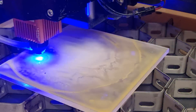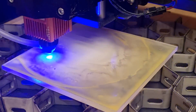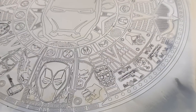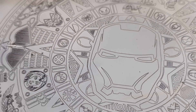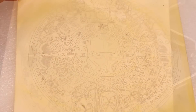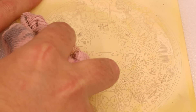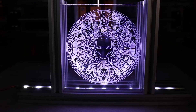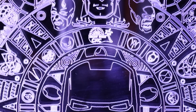Recently I needed to engrave some clear acrylic. A diode laser will not engrave clear products unless you apply something to the surface. So I experimented with something called Brasso, a liquid metal polish. You apply it liquid and it dries to a solid state fairly quickly. Then you can laser the surface of that, which will allow it to engrave into the acrylic, and then simply wipe it off at the end. The products come out really clean — you get a nice engraving in the acrylic, and what you can do is apply a little bit of light and you get great products like night lights.